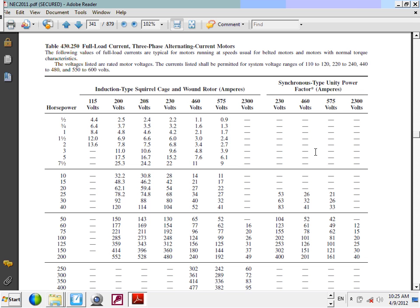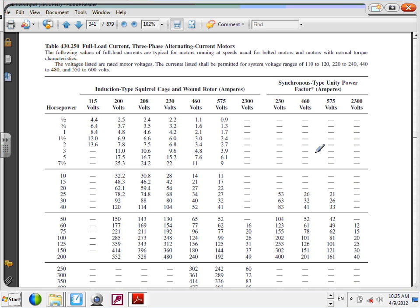So here's how you do that. We are in table 250, under a voltage of 230 based on this criteria, and we're trying to find the horsepower rating for the disconnect. I don't have a horsepower, so I need to find it. What was the amp? 70, the amp itself, not the multiplied one. Going down the column, I don't have 70, so I have 80. 80 is equivalent to what horsepower? 30. So we got 30.